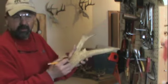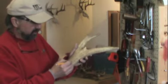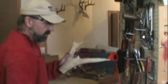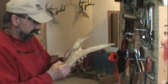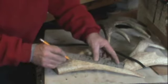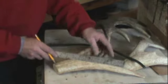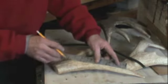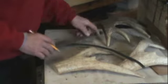That's what I typically do on my cribbage boards. I'll lay the marks out a quarter inch apart, so in one inch I'll have five holes. I sometimes use a flexible ruler — you can eyeball it too. If we're doing six groups of five with a half-inch space between each group, it's going to take eight and a half inches total room for the game counters.